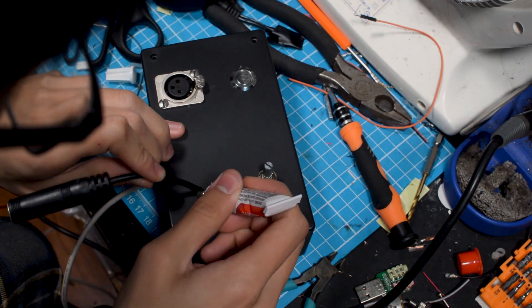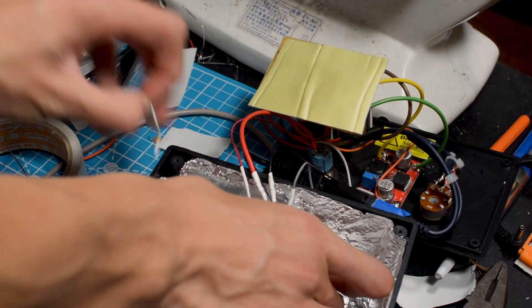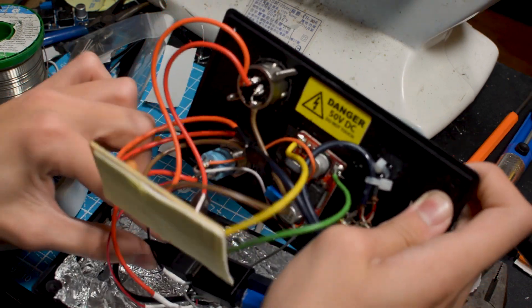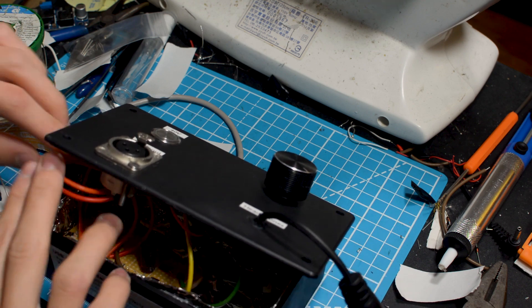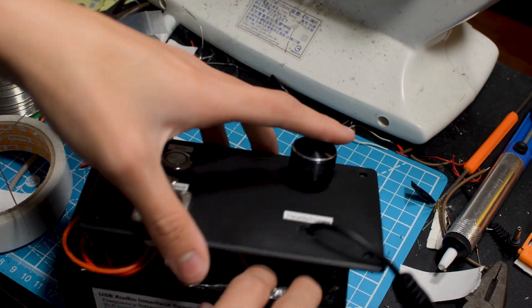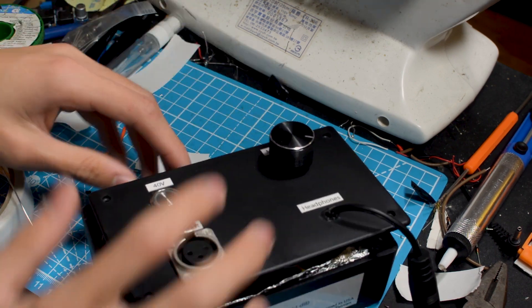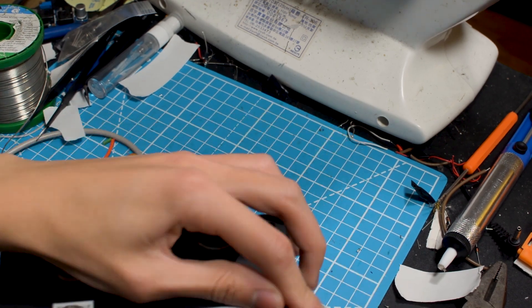I added glue to provide strain relief to the headphone jack. The last step is to cover the entire plastic enclosure with aluminum foil. Solder an extra wire from the ground of the USB cable and tape it to the foil. Be sure that the voltage booster and the phantom power circuit won't be shorted on the foil by adding tape to the back side of the PCB. You can now close the project box and ensure the button's metal casing is grounded as well.